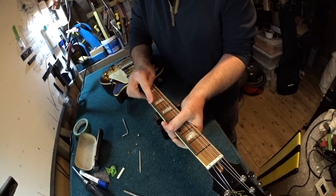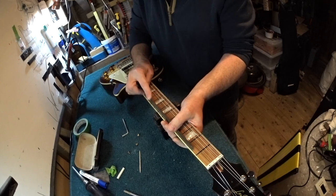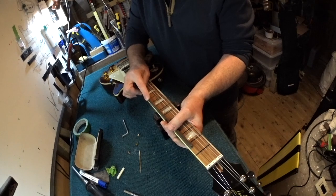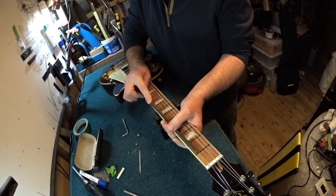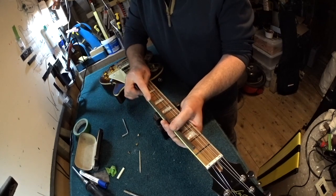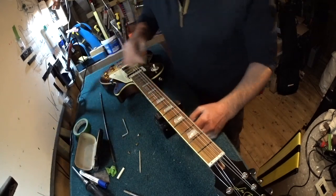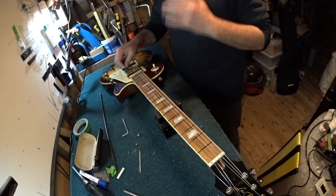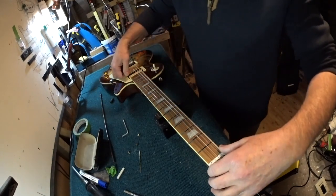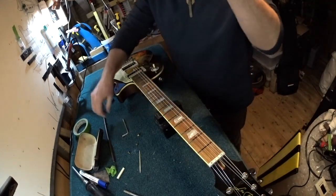Now, I'm just going to start leveling, just feeling my way with this rod, and mostly gravity. So I'm not pushing too hard. I'm just letting it do some cutting to begin with, and seeing what I see. Now straight away, what I'm seeing is cutting here, nothing there, cutting at the end there, which suggests to me that the calibration isn't quite right. If it was cutting in 3 different places, a bit here, a bit there, a bit there, I would say I was right.